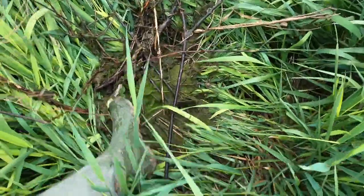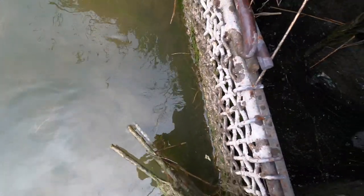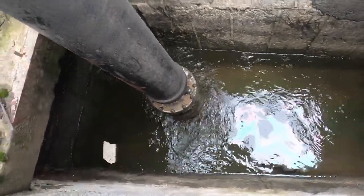This is all the crap that's on our screen on the front - this is moss. This is the screen that water flows through, and that's what keeps that crap filtered out for us. I don't know if there's any in the pump - I'll have to go check and see if there's anything on the bottom of the pump plugging it. Hopefully that screen got it all. I can't see anything on the pump down there.